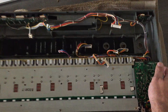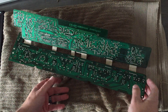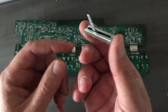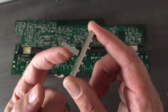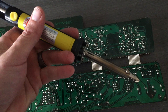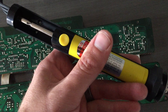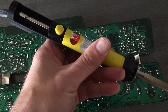This thing unfolds like that — not easily because it's old, so be careful on these. Here is a replacement one that I got from eBay. The sustain ones are different than the attack, decay, and release — for some reason the sustain slider is different. I don't know why. When you go to buy them, I notice they sell the ADR separately, and then you have to find a sustain separately, which I did here. I'll be using this fairly inexpensive solder sucker. There are some very expensive electric vacuum ones, but I'm a novice and don't want to pay $200 for one I don't use all the time. I've used this once before; it seems to work okay.